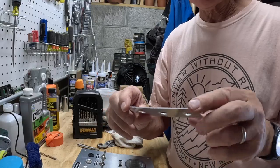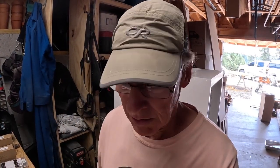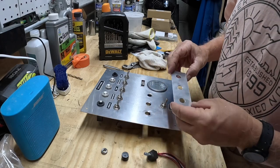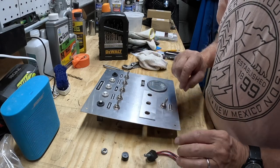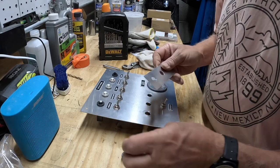I just drilled new holes and cut it. If you're wondering how I cut aluminum, I literally do it on my chop saw — I have a chop saw blade I've labeled as aluminum-only. You might know it as a miter saw. You can just cut aluminum like you cut a piece of wood; they wear down the blade a little faster so I don't use my wood blades. They'll cut right through nice and clean, and then you can use sandpaper to sand the edge for a nice finished product. So what I'm going to do is literally epoxy this piece onto this face, and that'll give me an eighth inch to work with so the nut will tighten down onto there and fit in the hole. Works great.